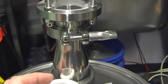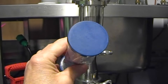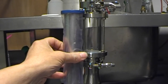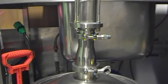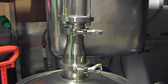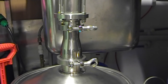This now gives you the opportunity to place this at the base of the column as your end piece and use it as a gin basket or any other chamber you choose. You could use something like a spool tube - in two inch tri-clamp it's a cheaper option than a glass one. You don't get to see the action but it achieves the same result. You can pack this with media, or use a sight glass - a combination of whatever you want. You could pack this area with botanicals and put a filter in the top so it doesn't keep blowing out.